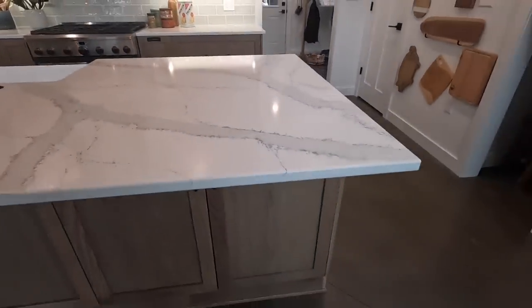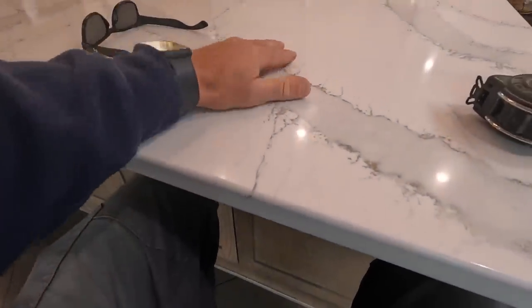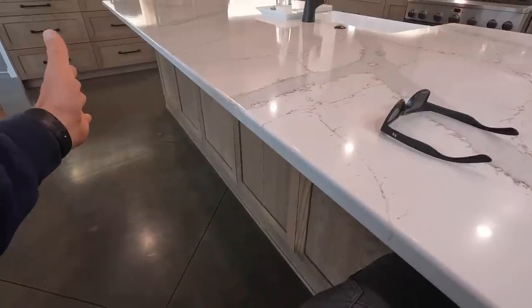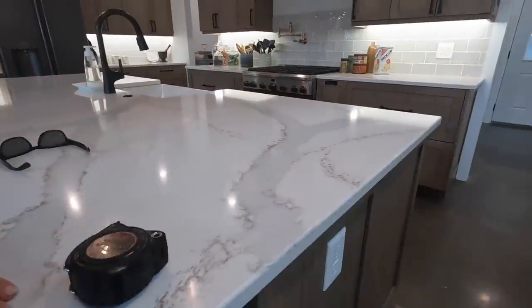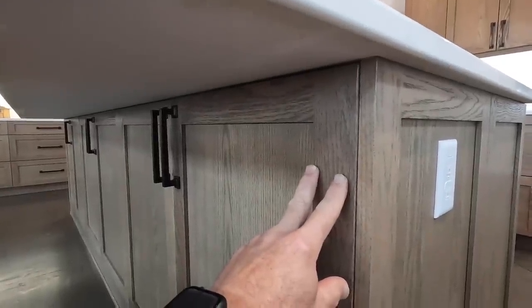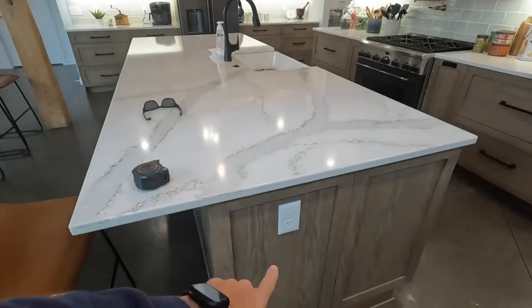As far as the overhang on the island, we are at 12 inches. I feel like 12 inches is a really comfortable distance for seating, and at that distance you don't need any metal supports or anything supporting your countertop. If you were to go out 18 inches or further you'd need to build in some kind of support — typically you'd use one-eighth-inch metal flat stock, router out the top portion of the cabinet, and have it come out and support the overhang. These are frameless cabinets so that would be a bit more difficult since the doors go all the way to the top. But you'll be really happy with a one-foot overhang for seating — it's comfortable and you feel like you're at the right distance.